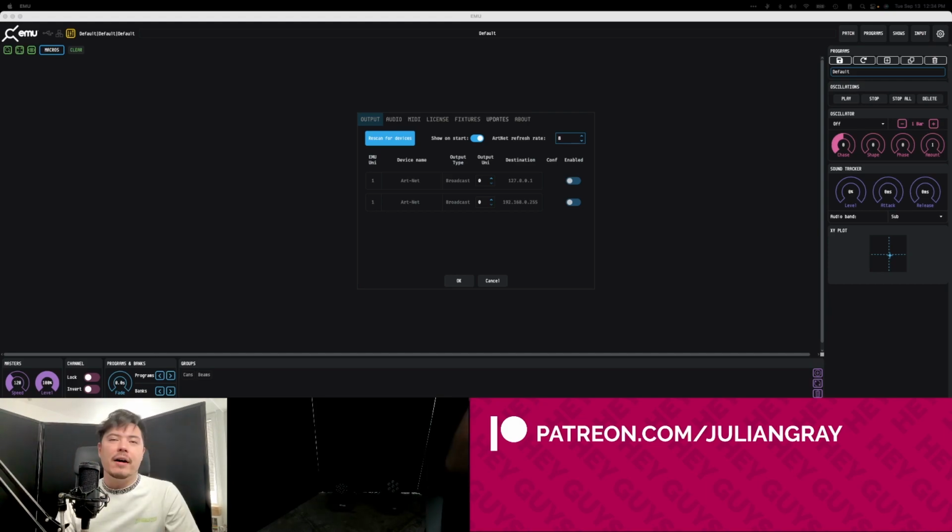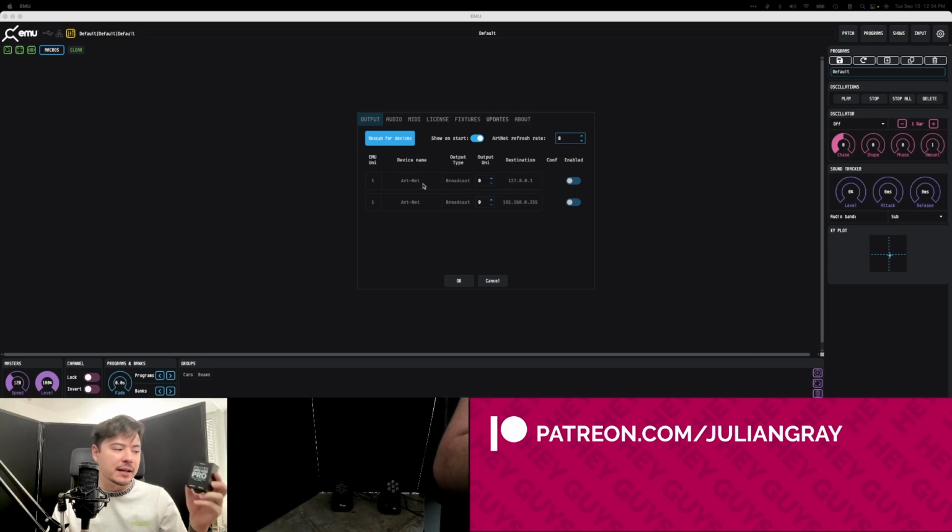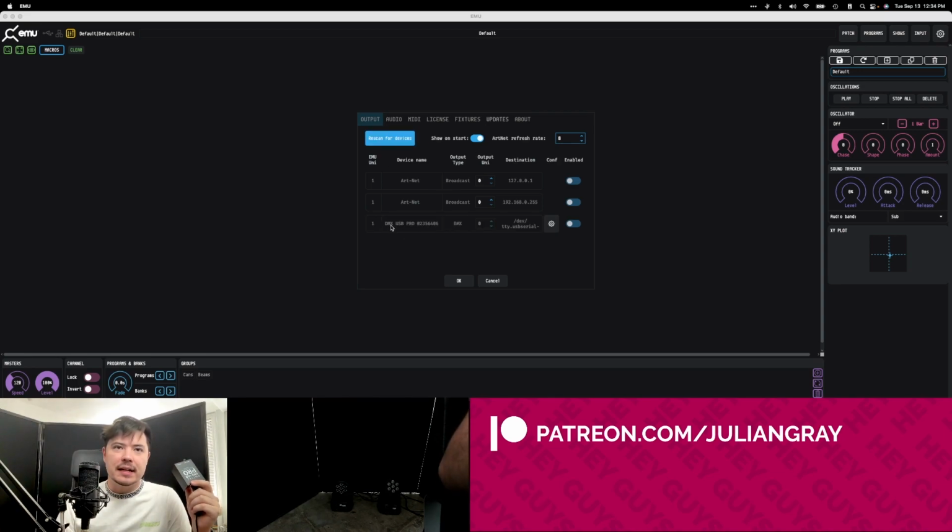All right, so when you open up EMU for the first time, you're gonna have to activate it. There's information on the website on how to do that. Once you do, you'll get to this page here. On this page, there is a list of all of the DMX devices on the network. What you're going to want to do is just plug in your DMX USB Pro. When you do that and you press rescan, as you can see, it comes up as DMX USB Pro down here.